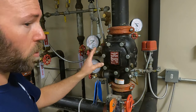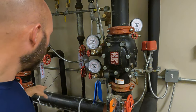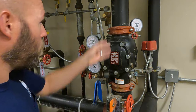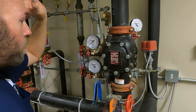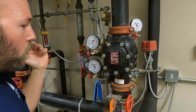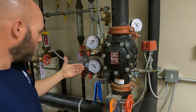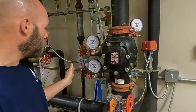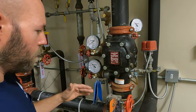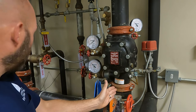If I didn't do this and went ahead and did my trip test — granted on this one we're doing a partial trip so we won't let as much water in — but if this was a full trip and there were rocks or debris, we're going to throw them up into all our sprinkler system. By the time we hear the rocks flying through, it's too late. So you always want to do a main drain test, open it up fully prior to tripping the system.